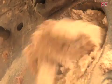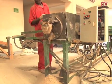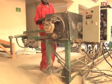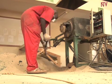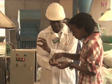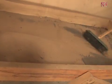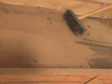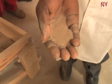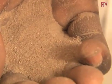To make a suitable tile, it has got to go through the sand dryer where all the moisture in the sand is gotten rid of. After drying, it is sieved so as to get rid of very small and big particles that can easily allow pockets of air or pores in the finished tile. Because once it is bonded it is a strong thing, and you cannot easily break it.